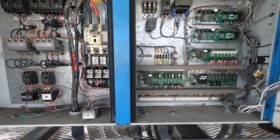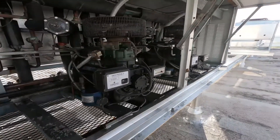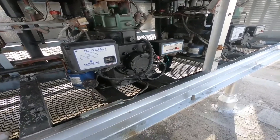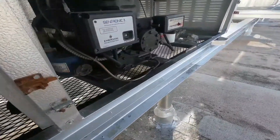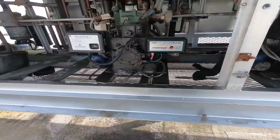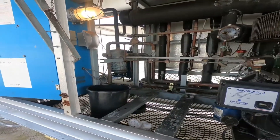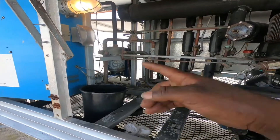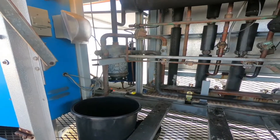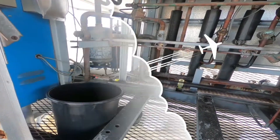I got a service call early this morning. This rack right here was down on oil - basically this one had no oil at all, that one was full. I used the oil pump to transfer some oil back over to try to get these oil pots leveled off. I back-flushed my oil separator; I wasn't getting any differential in my oil reservoir back there, and I'm still having issues getting my separator to work properly.